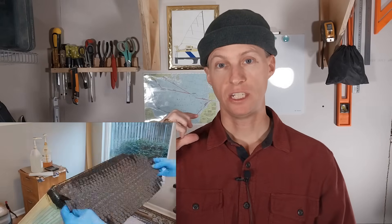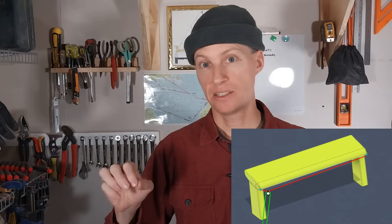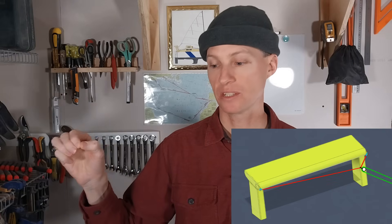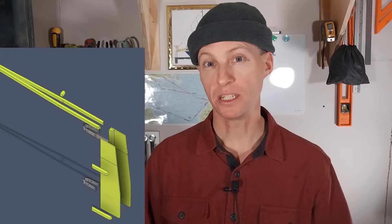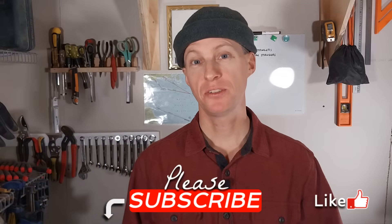On top of that you've got carbon fiber going around the outside of that G10 bracket onto the back of the arch, and on the inside onto the leading edge of that buoyancy arch. Later I've got to cover the entire horizontal wing of that buoyancy arch with more carbon fiber so the load of the sail is spread to the port and starboard main sheet attachment points, and all that carbon fiber works to spread the load evenly across the whole arch and down into the boat. I think that's a robust, great system. Let's go ahead and get these parts assembled — but if you are new here, please make sure you subscribe to help me grow the channel.